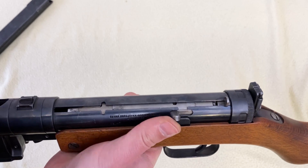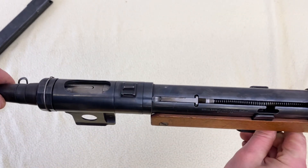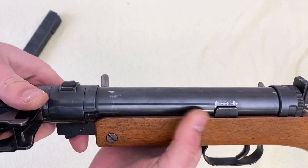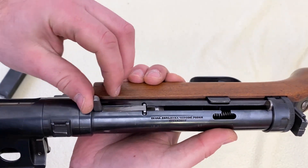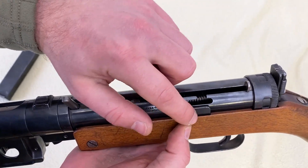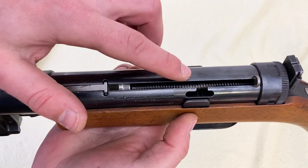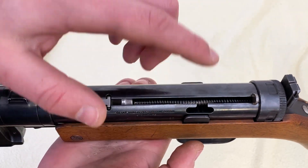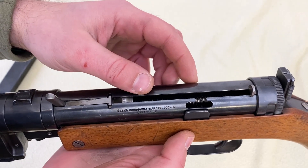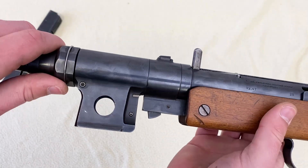Above the wings there's a cutout that works as a safety — you hold it in that position so you cannot fire, and when ready you move it back and fire. Because you can rotate the gun, there are no other markings — the charging handle can end up on the left side, or on top when rotated. The little metal wings on the sides cover the cutout in the body, which is there because the sear needs to engage the bolt regardless of which rotational position the gun is in.